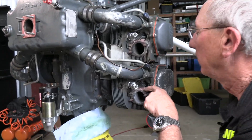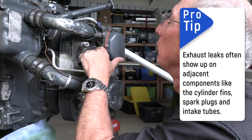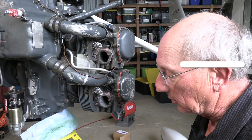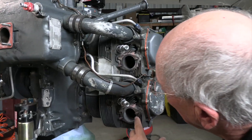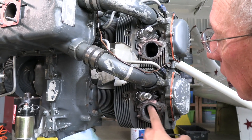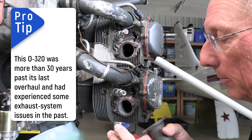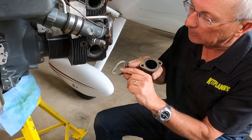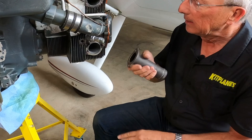This is a good place to observe a little exhaust leak — we can actually see it on this cylinder: a little bit of gray, a little bit of a rose color. Let's talk about how this exhaust joint works, because it's a place where people frequently get leaks. This flange is part of the cylinder and needs to be absolutely flat and nicely surfaced. Then you're going to have a no-blow gasket, which is an interesting little gasket with multiple pieces and a little compression in it. If you've got just a flat gasket, throw them away and get a set of these — they really don't cost very much.